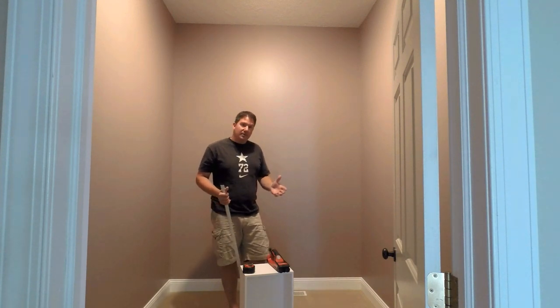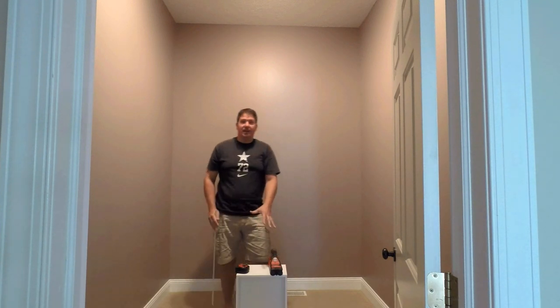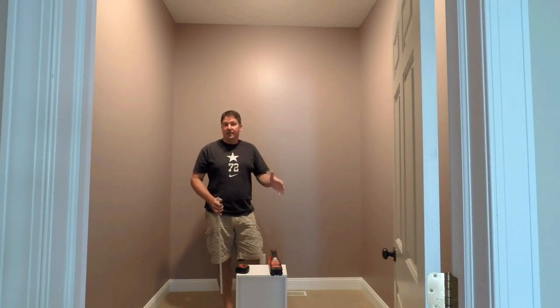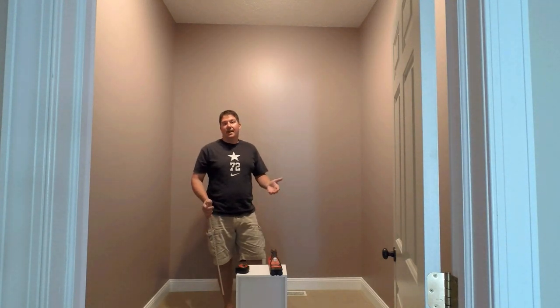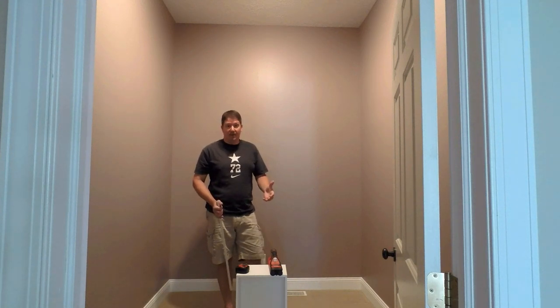What I'm doing now is putting together — I had 12 separate drawers. Very easy to put these drawers together from Easy Track. Basically they come all in one piece. You fold them up with the center in and pound them down. There are some dowels that you just pound into place — they're pretty tight. I took some extra time to make sure I got glue everywhere they wanted it, and added a little bit extra for my own peace of mind. Made sure they were square and I'm setting them aside to dry 24 hours. One tip: when putting drawers together, remember the glue is easily wiped off with a wet rag — so keep a wet rag next to you.